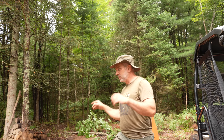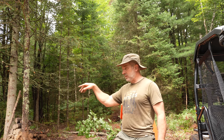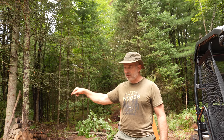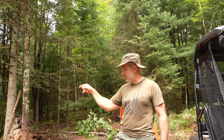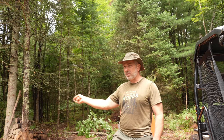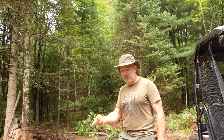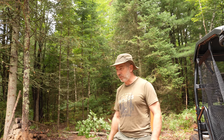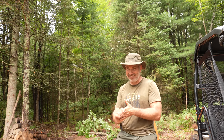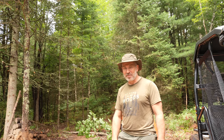Right now there's two walls and then a center wall, but I need posts in the ground, like pillars, 6 feet into the ground there and there, to carry the center beam that crosses. It's like a floor beam, I guess. So that's the plan.